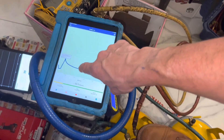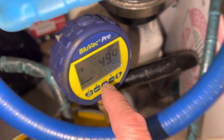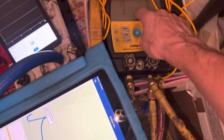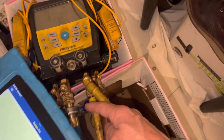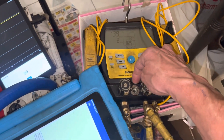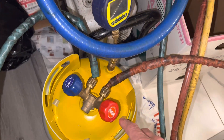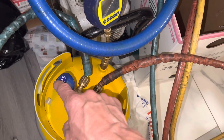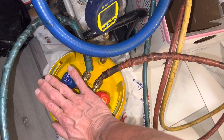It's been a while. I hooked up the hoses like I explained in the last video to this tank, and as you can see, the tank is at 50 microns. Here's the Field Piece software — it's reading 39 microns because the micron meter sensor is right here in the middle of the manifold. The vacuum from the hose takes the shortest route right to the micron meter, but then it has to pull vacuum through these long refrigerant hoses going to the tank. From the previous videos I was able to get the tank down to 26 microns. Then I hooked up the whole system and opened the valves to pull vacuum through a known good tank that is dry, tight, and clean so we can see the difference.